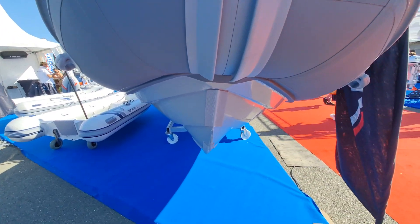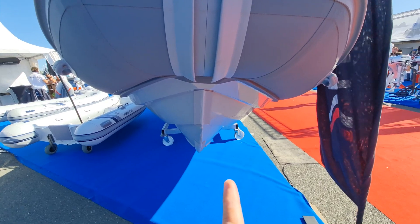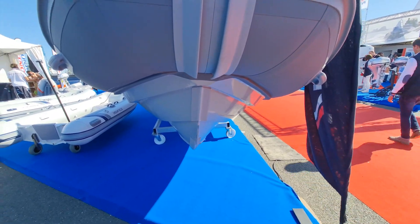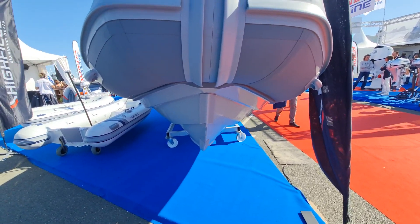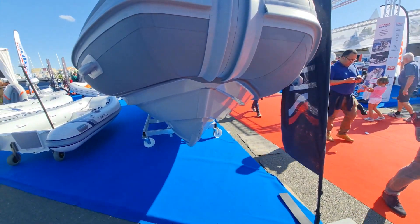You can see with this Patrol hull here — it's immensely sharp, the sharpest in its class. You would notice that when you're running over the chop, the bow of the boat just slices through. That means the deadrise angle, which on this boat is 26 degrees, is allowed to do its job, and that job is to give you an extremely soft ride, a really supple ride — a comfortable place to sit for hours on end.